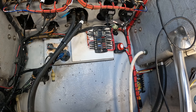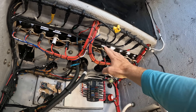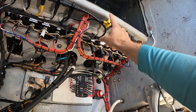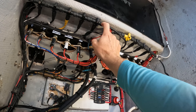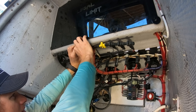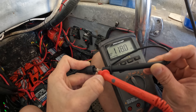We need to figure out why there's an extra 10 ohms of resistance. I want to test this section separately because I think this part has to do with the engines. There's a power isolator here — my guess is this section of the backbone gets its power from the Suzuki engine side, and the isolator makes sure that power can't feed back to the other side. So we're going to unplug this, move the cable, and check to see if that terminator shows up correctly. We're getting 118 ohms of resistance — everything looks good from here over to here.